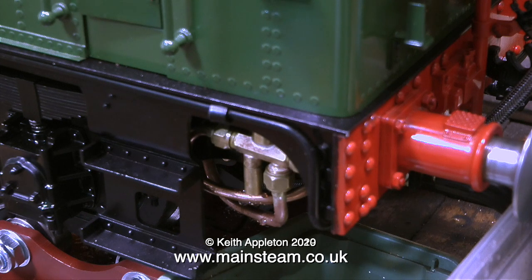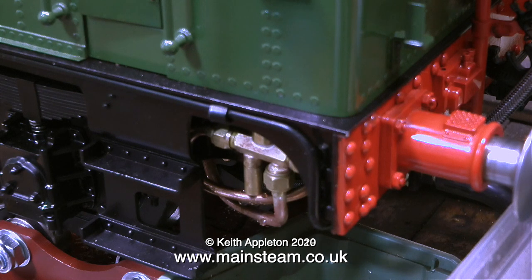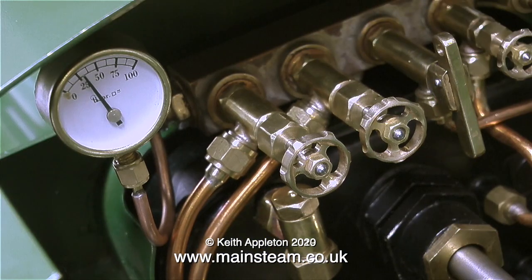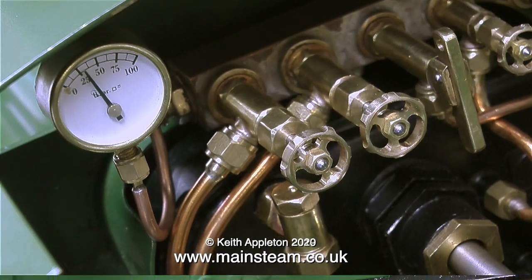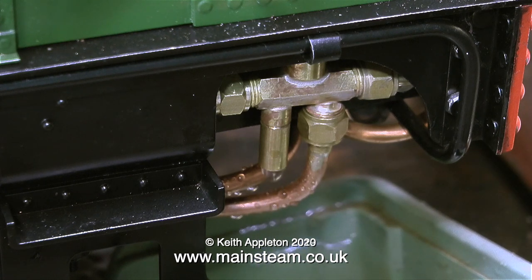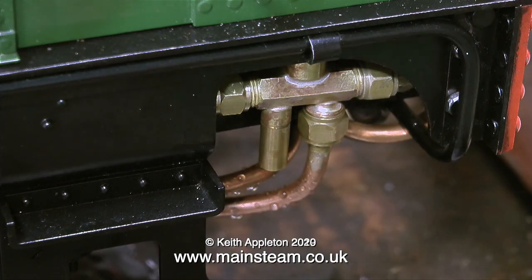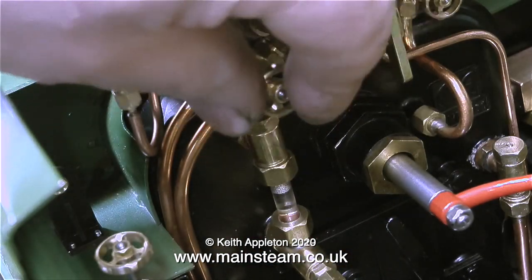These injectors pump a lot of water into the boiler, so as the boiler fills up the pressure drops and you have to readjust the water feed to make allowances for this. Generally speaking, the Jubilee Fittings injectors I use normally run from about 110 pounds per square inch down to maybe 30 pounds per square inch. When the boiler fills up, water starts to flow faster out of the overflow — when it's coming out of the overflow it's definitely not going into the boiler. But even at low pressure, when I adjusted the water flow it picked up again. Here you can actually see the water going up the glass.